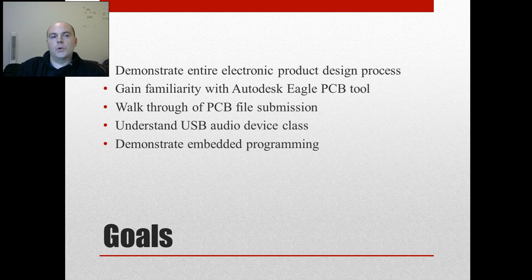After you've built your circuit board, we're going to walk you through the process of submitting it to a board house. There are lots of YouTube videos about that, and vendors like Express PCB make their own CAD tools — those are perfectly fine, but they lock you into a particular vendor. By going through the process of creating Gerber files, you're universal. Everybody takes Gerbers, everybody takes Excellon drill files, so you can use any board house you want.